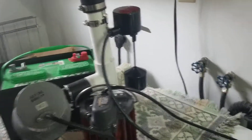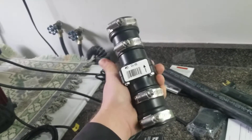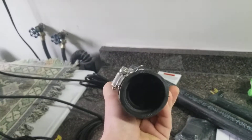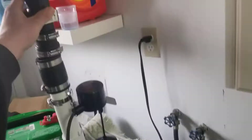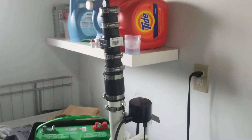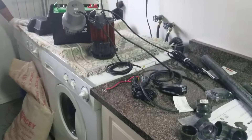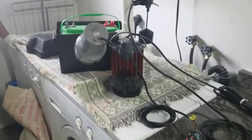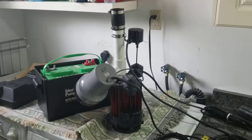Sometimes on new builds you don't see a discharge pipe coming out at all — sometimes inspectors want to see it. This is a check valve, a one-way valve that doesn't let water come back but lets it out. We install it just above the pit, and when the inspector requests it. This installation is in North York. The customer is really enjoying this kit — we'll give you an update once it's all assembled. Thanks.